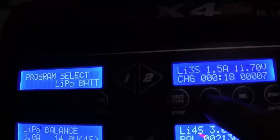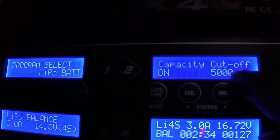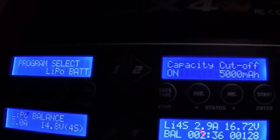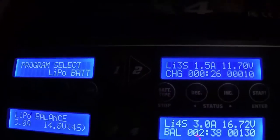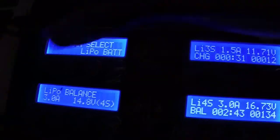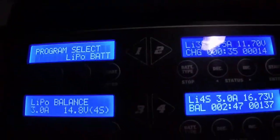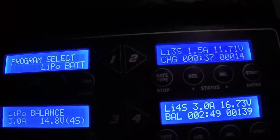Let's go through the same checks on this one. This one is set at 5,000. If you're going to charge batteries over 5,000 milliamps on any one of these numbers, you have to change the individual number — each one has its own bank for the settings.